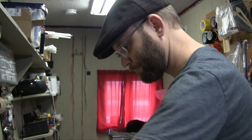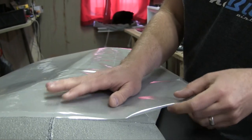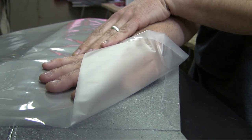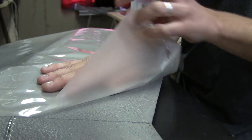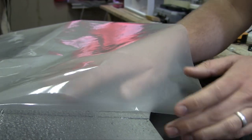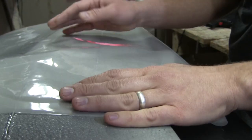There's no grain like working with wood when you're dealing with laminate, but there is a side to it. Take a look at this — you see how there's an opaqueness to the laminate? There's one side that's opaque and the other side is a gloss, kind of shiny. The opaque side — that's the adhesive. You always want the opaque side down, glossy side up.